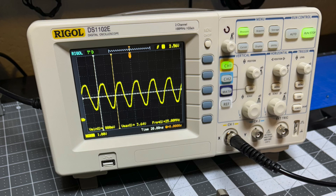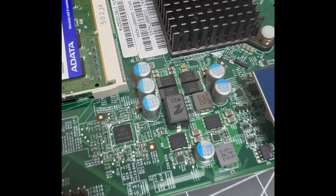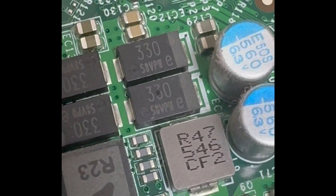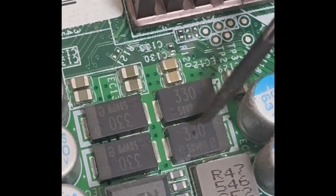That's pretty standard for what you would expect for a high and low signal, so I had to look elsewhere. I scoured the board for anything that may have let the smoke out, and sure enough I found one of these telltale pinholes on a capacitor. When you see one of these dots on a surface mount component, it usually indicates an internal short that melted through the case.